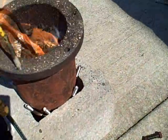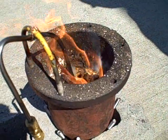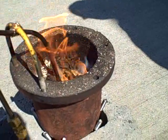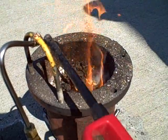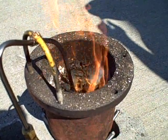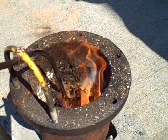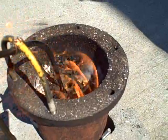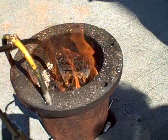You can also notice right here on the steel tube that we're using for directing the air down to the bottom of the bed, you can see some collection already of tars. That's not soot — those are actually semi-solid liquid tar elements collecting on the tube. That's one of the byproducts you have with pyrolysis, especially if you're not drawing the vapors through a hot bed of carbon. You get a fair amount of tar content.